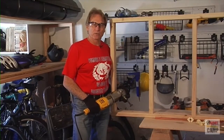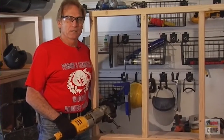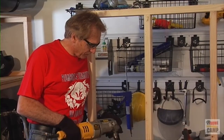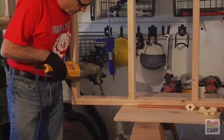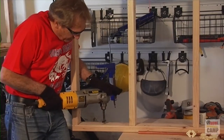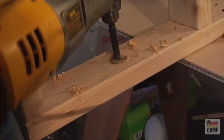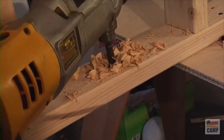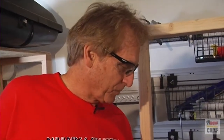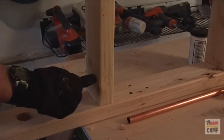There's also a factor in the wood. If the wood is green — meaning it's recently cut and wet — the bit probably will not cut through it very well. You want fairly dried wood, otherwise you're going to be spending a lot of effort. Take your time, locate the worm bit right over the mark, and brace yourself so you can control the drill. Before you start to drill, make sure there are no nails coming through, especially at the junction of the stud and the plate where nails come through to a certain height. Drill the sideways, horizontal hole now.